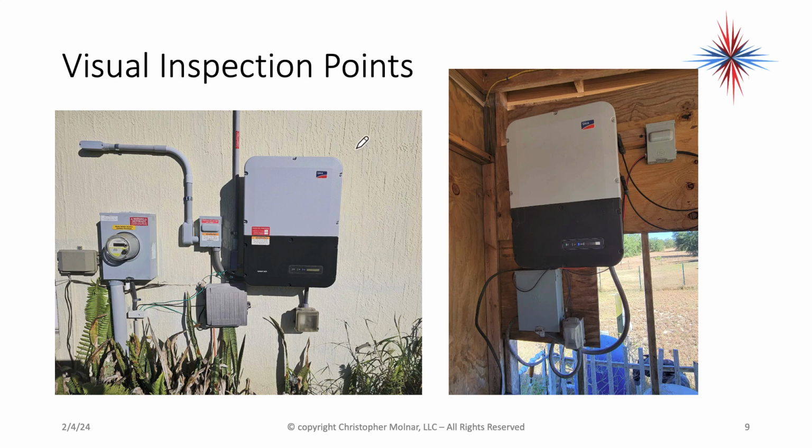See, here again, I have an inverter, so I know it's a string system. Second inverter, I know it's a string system. This inverter has an extra outlet at the bottom of it. Believe it or not, if power goes out, you can flick the switch on and you can still use just that outlet and not lose your islanding capability.